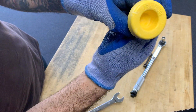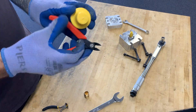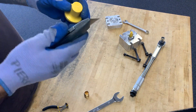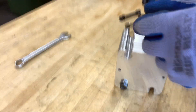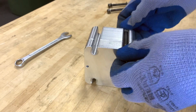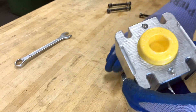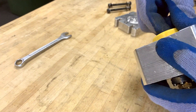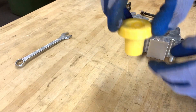Spend the time now just finishing the part — trim off any excess while you wait for the plastic to melt. A couple of minutes later we've got our next part ready to be taken out of the mould. You can see we've got no shrinkage and no flash, just a consistent part. Thanks for watching our video on the Precious Plastic injection machine upgrade using a hydraulic press or a log splitter.